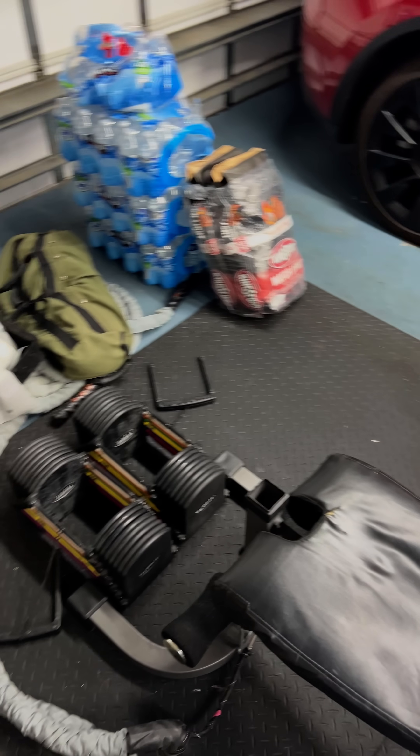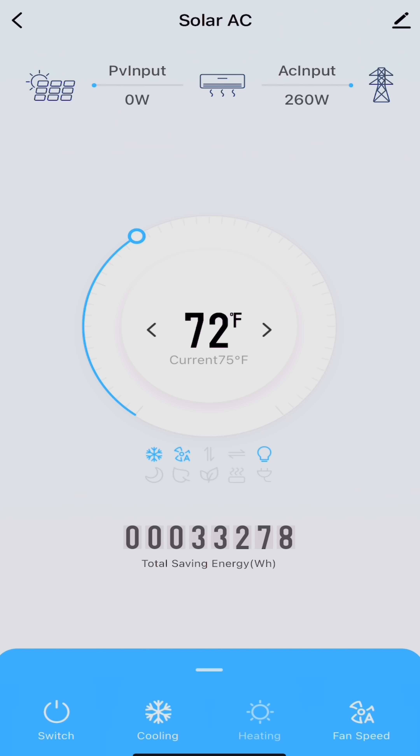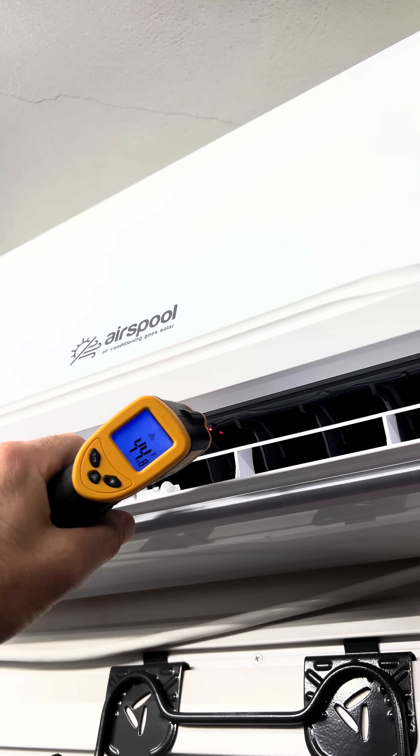But of course if I start working out in here and want to cool it down as quickly as possible for a short time, I can just turn off the AC limiter and it will go back up and run the compressor at full speed — because obviously when it's limiting AC input and there's no solar supplement, the compressor is not going to be at full speed.